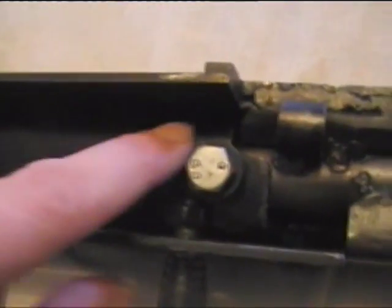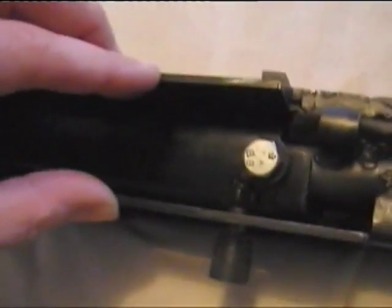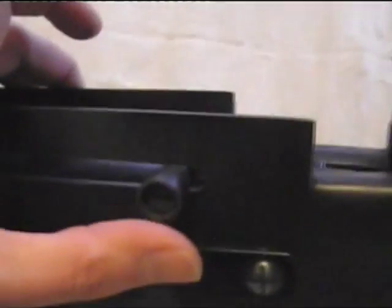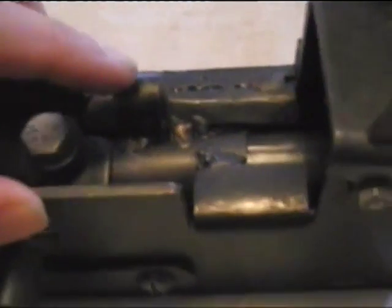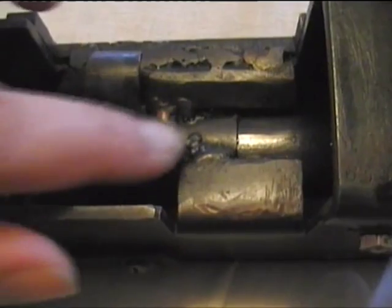I've got a metal steel plate which is folded like a piece of U-section steel. It fits down over the two sides of this round pipe to simulate the bolt inside the .30 cal of the original one. This gave me a way to weld the nut onto here and secure a cocking lever to it.